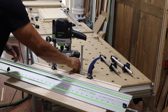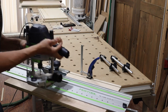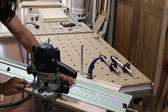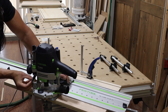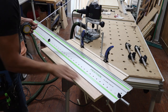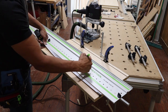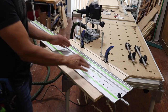I want to go 9mm down for the shelf pin depth. To get that depth, I'm taking a 5mm and a 4mm domino, placing the system on top of the workpiece, letting it find its equilibrium in the hole, zeroing out the router and locking it, then raising the stop on the turret and dropping it down onto the 5 and 4mm dominoes and locking that in place. To find the center of the panel, these are at 672mm so I divide in half to get 336mm. I mark that as center and go three holes above and three holes below — you don't want holes all the way top to bottom or your panel will look like Swiss cheese.